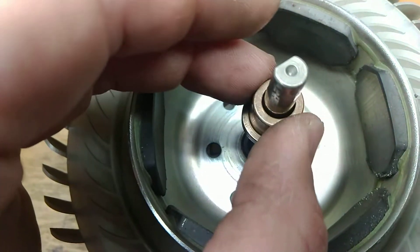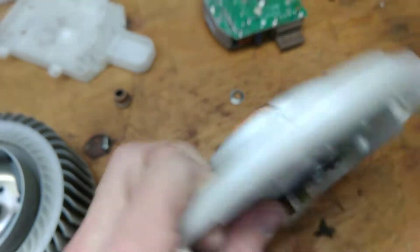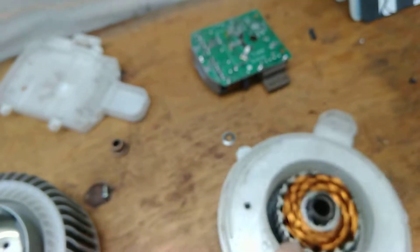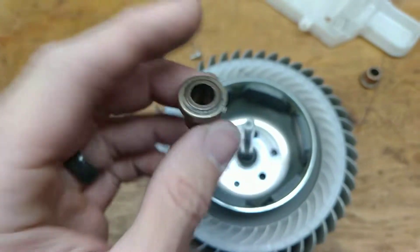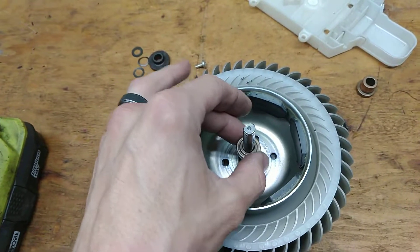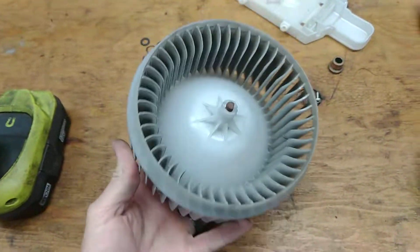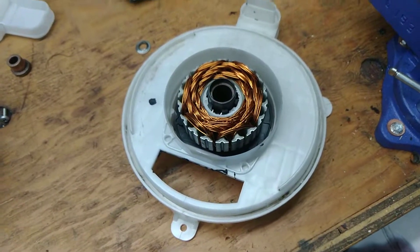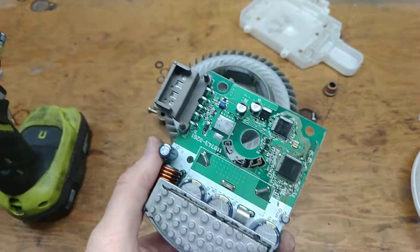I'd say that's got a little excessive clearance on it. Let's get the other one out and check it too — I'm going to actually see some damage on that one. And ooh, that's really super loose. That's why these fail, typically. It'll make a really loud growling type noise and the controller will see excess load and just shut it down.